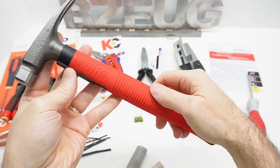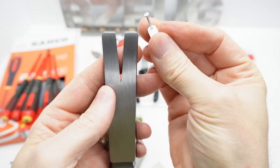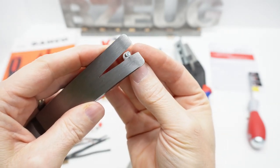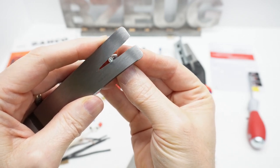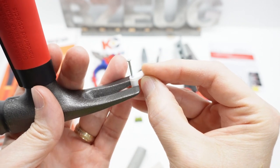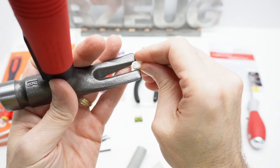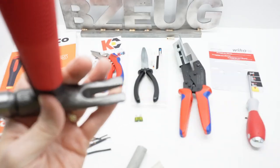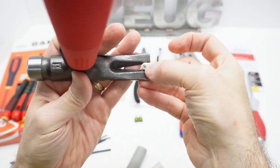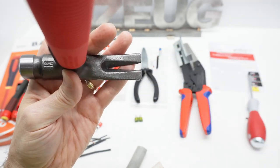It's also a nice hammer just to use as a regular hammer. I noticed the gap on the claw is quite wide — so for the small anchors shown in the marketing material, the tiny nails can't really be grabbed when they're up against the wall. Even smaller cable staples are too small for it to grab right at the edge. A regular wire staple is fine, but for smaller wire staples you have to go back further on the claw. If clearance is the design goal, a narrower claw would have been a better choice.